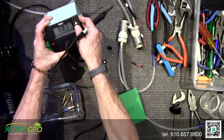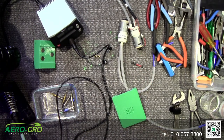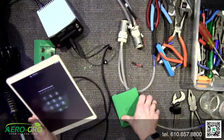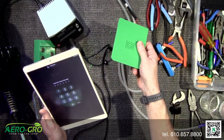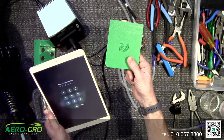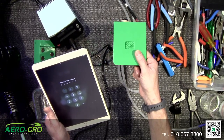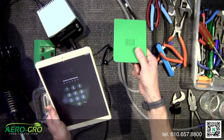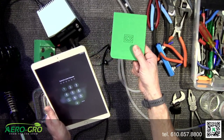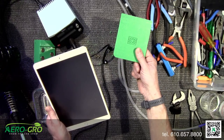Let me think here. Hold on. What's the temperature? Let me look that up again. I think I have that wrong. So, all right, here's how you figure it. PETG, this material, turns into a glass state, or melts, at around 210 degrees Celsius. Celsius, not Fahrenheit. I print at 240 degrees. So somewhere between 210 and 240 degrees is the right temperature to melt this plastic.